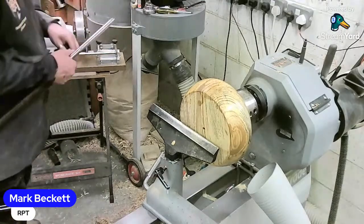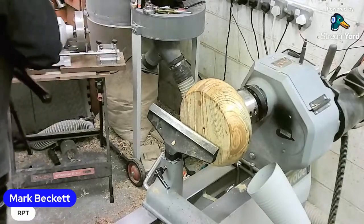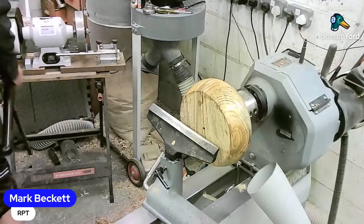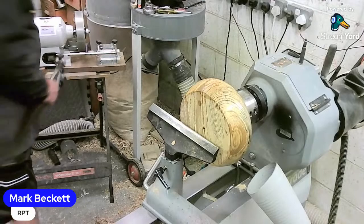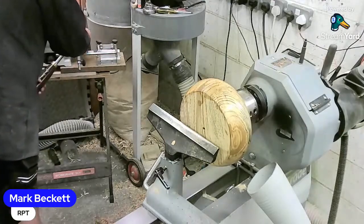It's a matter of choice. At the end of the day, if you put that microcrystalline over the top, it's got a hard shell over the top of it, which doesn't get affected by being in the sunshine in front of a window in a dusty room. Doesn't get affected by fingerprints. And it's also vegan friendly because it's made from petrochemicals rather than beeswax.